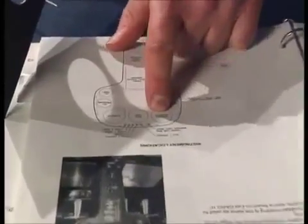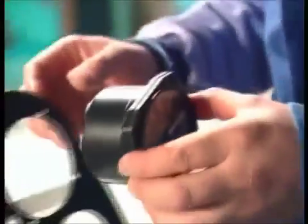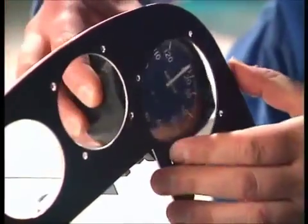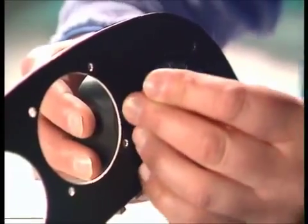Put it down. I've got my sticky black plastic on and it's all cut out ready for the instruments. I've got a diagram here in the manual. I'm starting with the airspeed indicator, the ASI. Now what a lot of people do mistakenly is mount it from the front, and it looks exceedingly ugly that way round because that's not how it's designed to go. It should go in from the back, and then it looks lovely. Just four bolts to fix it in place.